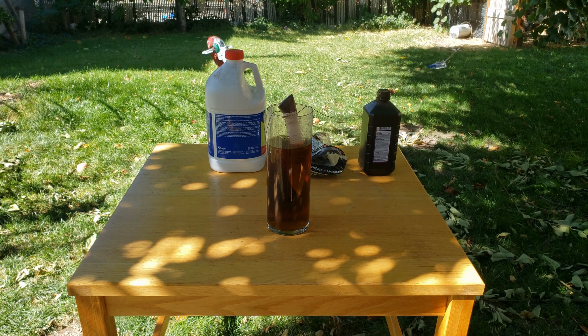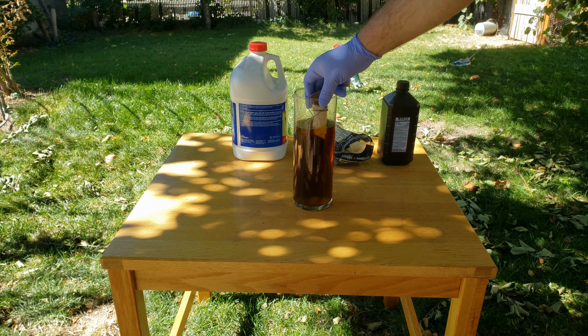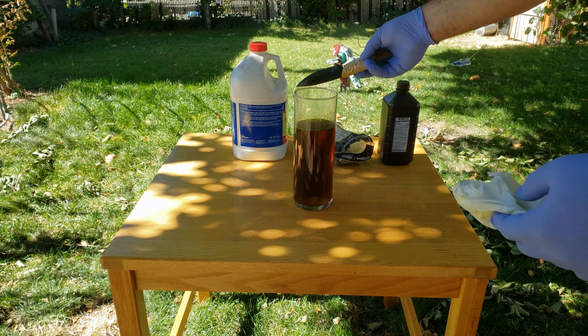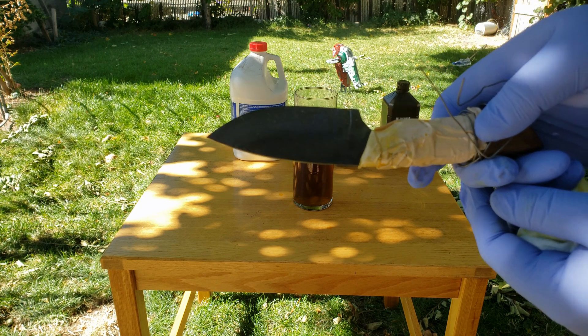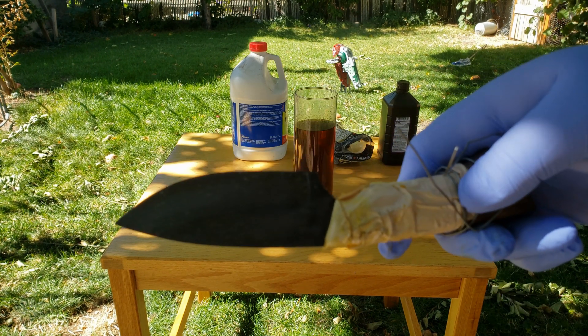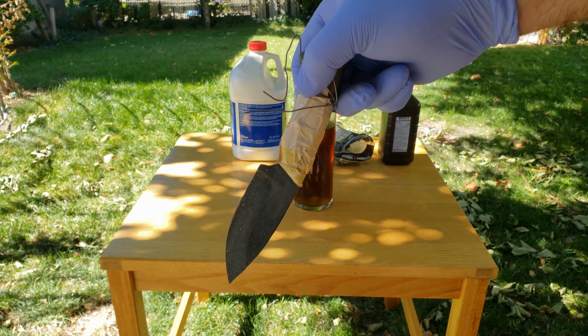So it turns out the isopropyl alcohol wasn't quite enough to clean the steel well enough to get an even etch over everything, so I had to go back and eventually found some acetone that I was able to use to clean off the blade. And after that, the etch took pretty well. The lighting's a little bad so you can't see it very well, but here's what the knife looks like after the etch. I generally really like how this looks on the knives, but on this one in particular I think I might have liked it a little bit more without the etching done. So I may actually go in after and just resand this down, but for the sake of demonstration, this should work just fine.